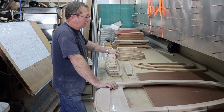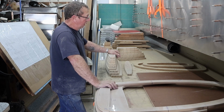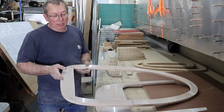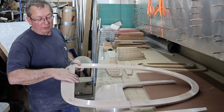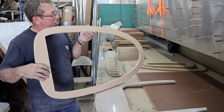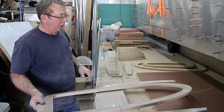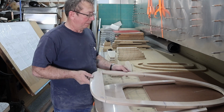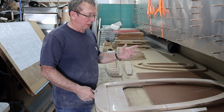I still got to check a couple of other little things and figure out what we're gonna do on these bulkheads that I built. You only flange them one way, so it was only necessary to flange them probably on this side, is the side that I would have flanged them on. I went ahead and radiused the other side just for the simple ease of handling and keep them from chipping on a sharp edge or something like that. So it'll protect the bottom edge a little bit more. But in the real scheme of things, it didn't make a bit of difference.